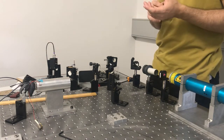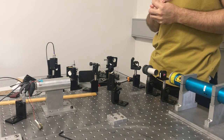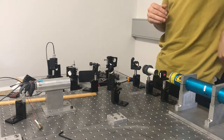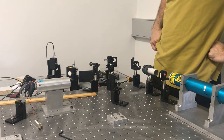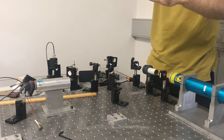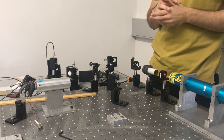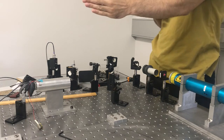There is only a small aperture where light will actually transmit through the mirror and not be clipped by the aluminium casing. I'm tuning these steering mirrors so that the beam is hitting the middle and coming back down the same axis, not going off to the side, because ultimately I want the beam to be resonant — it has to be coming in and then back and then back again.